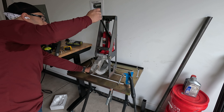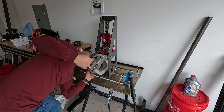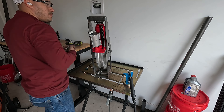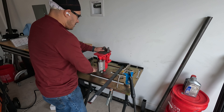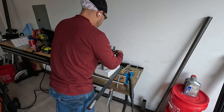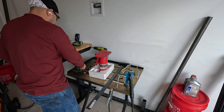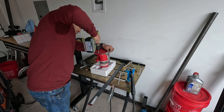In order for the die to bend the metal a full 90 degrees, the jack pivot plate would need to be flush with the front of the jack. So I ended up disassembling everything, lined it all up again, and drilled new holes making sure to clear the jack hydraulics and any molded supports on the base. The affordable bender jack pivot plate came with one drilled hole and one bolt, washer, and nut combo. I ended up using a Dorman bolt set from O'Reilly's for the actual mounting since I used two holes and needed to clear all of the hydraulics.